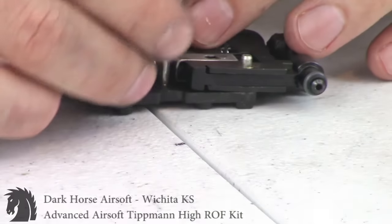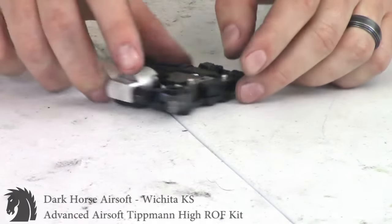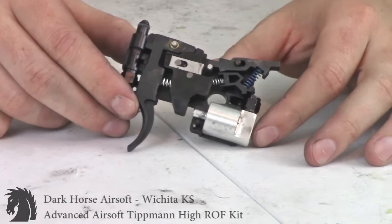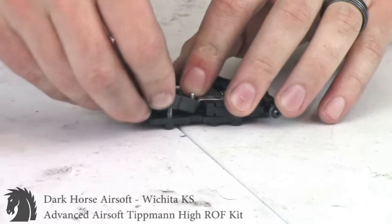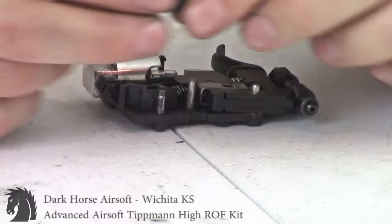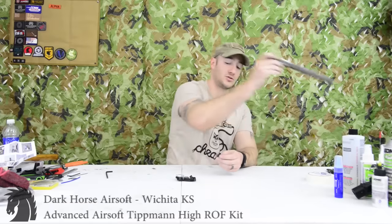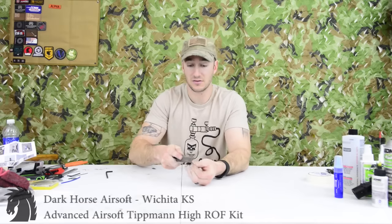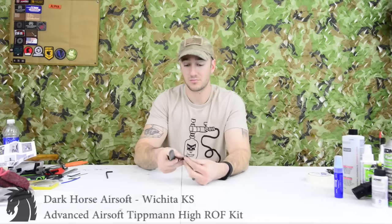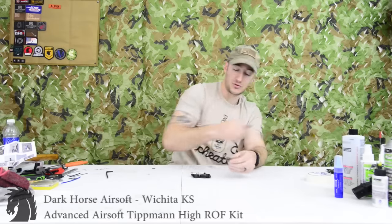I'm going to reassemble it briefly just to show you what the insides look like, in case you're a little wary about taking it apart. Here's a shot of what the insides look like. Now I'm going to take this sear back off. In the event the sear was rubbing the actual sides of the trigger box, you would simply take a file, a Dremel, whatever, and shave down the thickness — the width of it — giving it some strokes on both sides evenly. Mine's not dragging so I'm going to let it be.